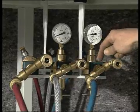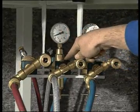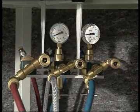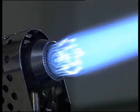To prevent gas backflow into the air or oxygen line, or air or oxygen backflow into the gas line, gas reflux safety devices with flame traps, as stipulated in DIN 8521, must be installed in the main lines.